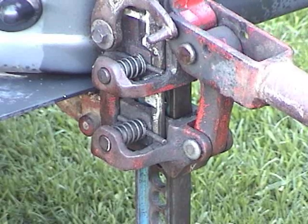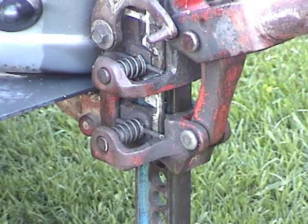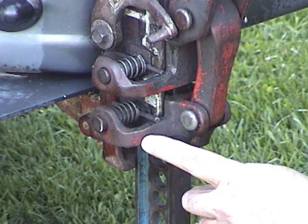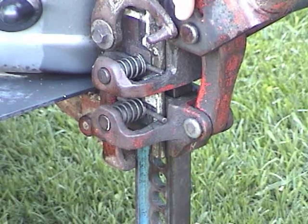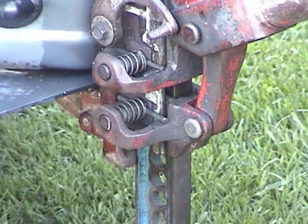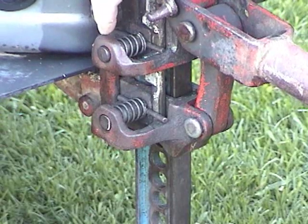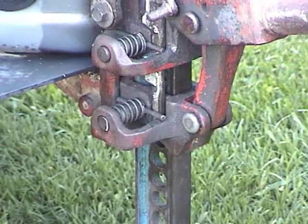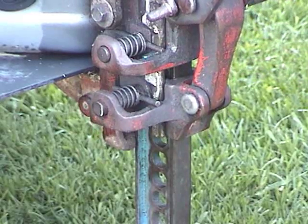When I let the lever go, the truck stays there — I don't have to hold or push on the effort end anymore. Lifting up on the effort end brings this other pin up down here, which locks at this point. And in fact, what it has done is raised the fulcrum — the fulcrum's up here now. When I push down again, up goes the truck again. This pin drops in, locking the truck in position. Lifting this then moves the rest point for our fulcrum up higher.